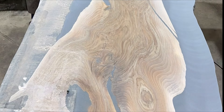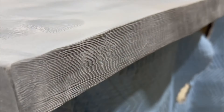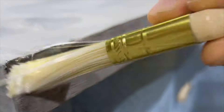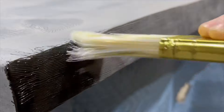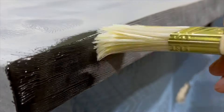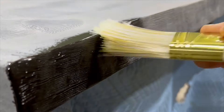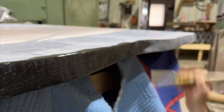After that point I'm going to get to sanding the top. Even though I passed this through my wide belt sander, I still have to go down to at least 100 grit to start out and work my way up all the way to 320 grit. The wide belt sander is great — I find it's best for making sure everything is perfectly flat. It does however leave lines from the belts; it is an older machine, so I take the good with the bad a little bit on this one.